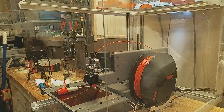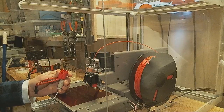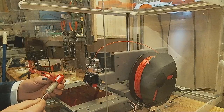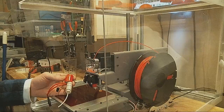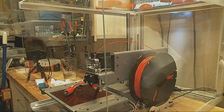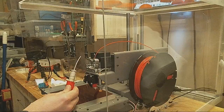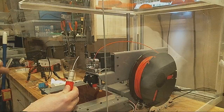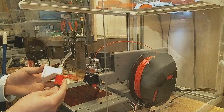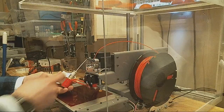I got to the point where I was trying to figure out what could the problem be. I was torching my tip — basically every time I'd use it, I'd torch it first and just make sure it was 100% clean, push filament through by hand, and make sure it wasn't the hotend that was the problem. Through my research, I found that if this tube gets too hot, that can cause blockage. So I went and made a little tube fan mount, and it worked really well. Even with all the problems I was having, it was this tube that was overheating.